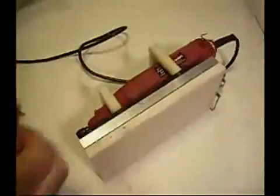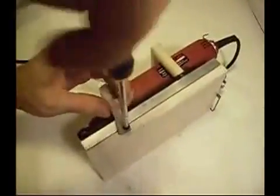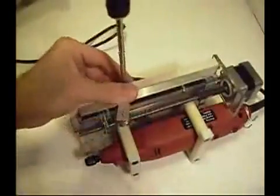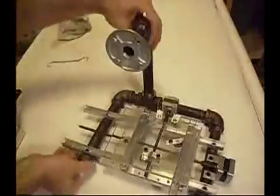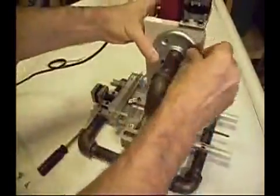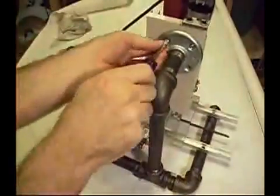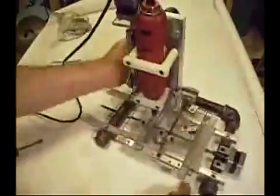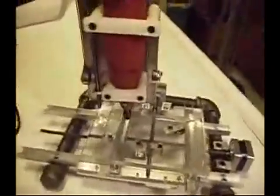These four posts are for the motor to mount in. You see the stage is gonna kind of flop around there, so we add these extra roller bearings to hold the stage to the rails. There you go. Now you hook the Z axis to the upright and you're good.